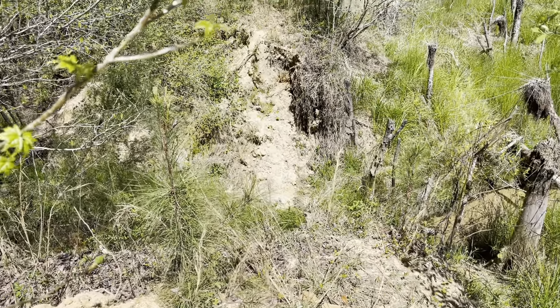This is the only way to get to the property we have in the back — there's another pond further back and it's just hard to get to. I want to get down there and clear that grass out, all the trees and stuff, get all that mess out of there, then start pushing dirt in there on top of it, get it up just a little bit, and then set that pipe — make a good bed for that big culvert to sit in. I've got a good pile of dirt right here so I can start pushing as soon as I need to.